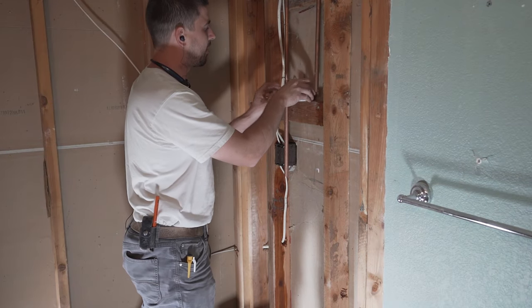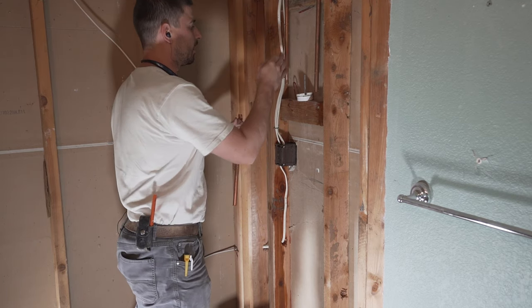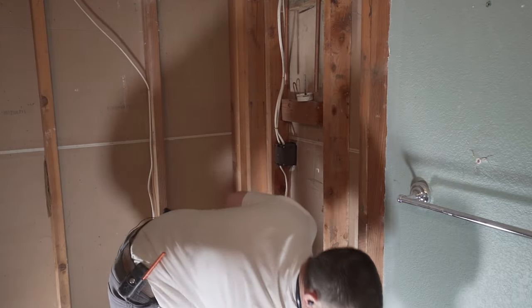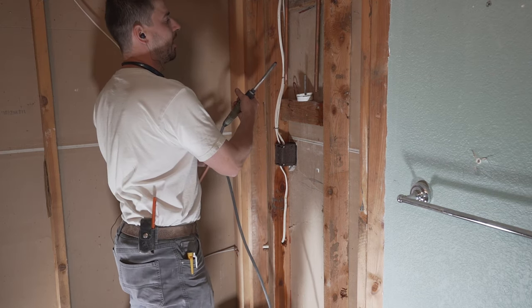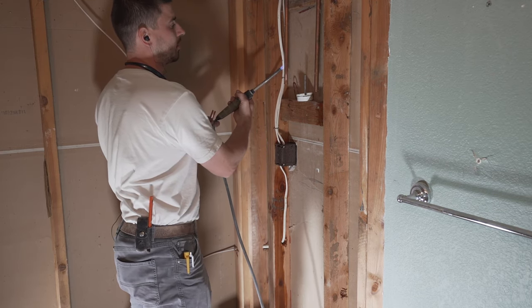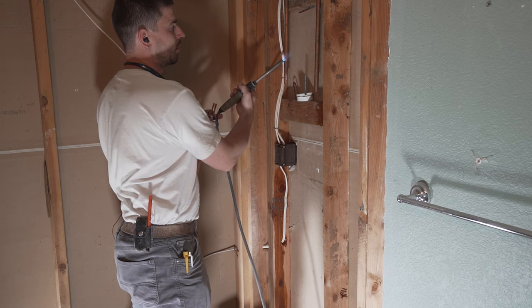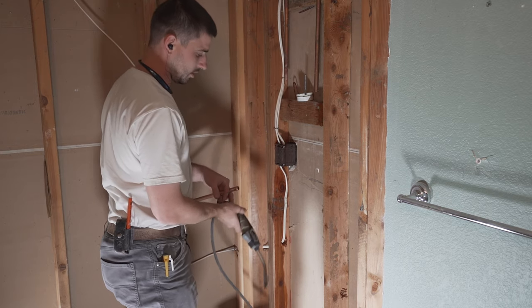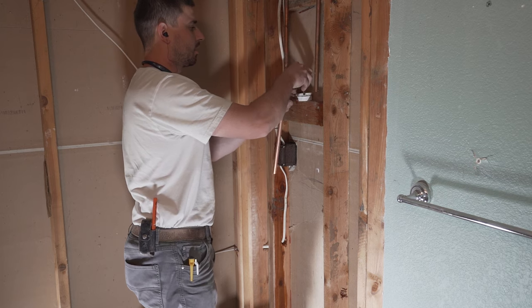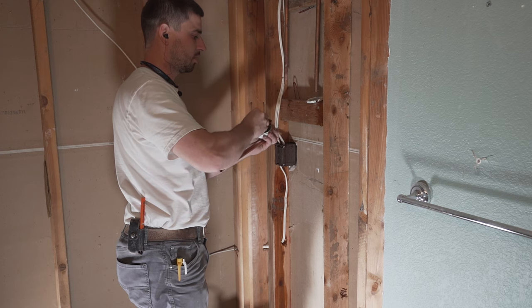All right, and basically, now make sure there's no water in here because it will not solder on, okay? This thing seems pretty dry. Let's dry it out a little bit more. Just give it a little heat right here. All right, nice and dry. Let's apply the flux.